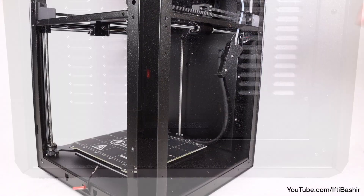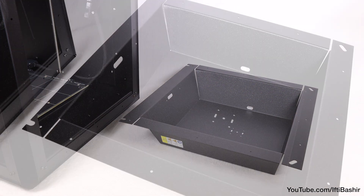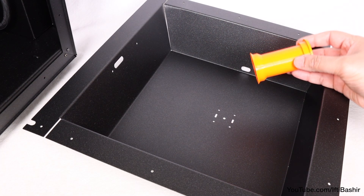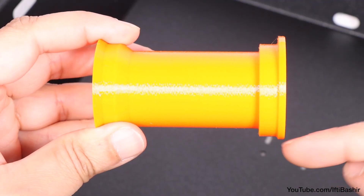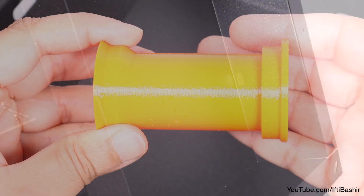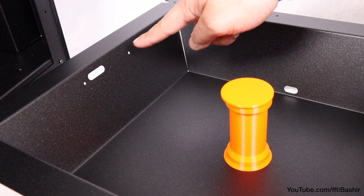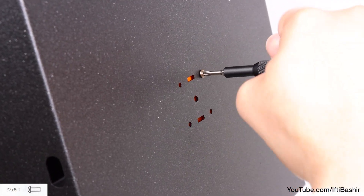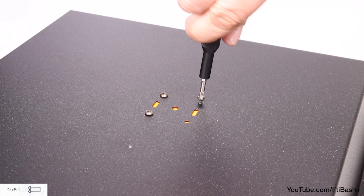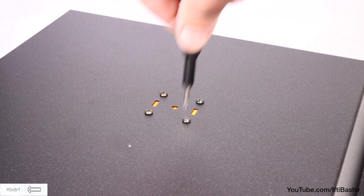Moving round to the front right side, take the right side panel from the metal parts package — specifically the side with screw openings in the very middle, used to attach the spool holder. The spool holder from the printed parts package has a lip that is slightly more raised on one side; this raised lip must point upwards when installed. Place it in the middle of the metal sheet with the raised lip pointing toward the three openings just above it, then secure with four M3x8 screws from the opposite side — going straight into plastic so tighten until snug without over-tightening.